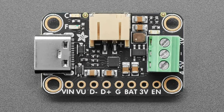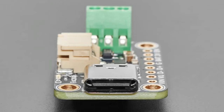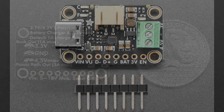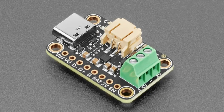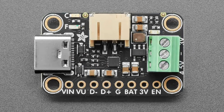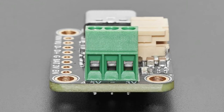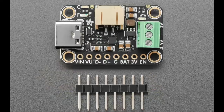The second board is the BQ25185 with a built-in buck converter output. If you liked that USB or solar DC charger but wished it had a 3.3V output for your projects, this is the one. It has USB input to charge your lithium-ion or lithium-polymer battery. Default charge rate is one amp; cut a jumper on the back to change it to half an amp. Plug in your battery, plug in USB, or use the V-in pin for solar or DC input up to 18 volts — though I wouldn't recommend very high voltages since it's linear and could overheat.